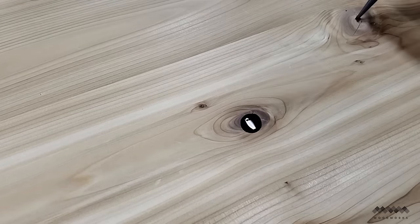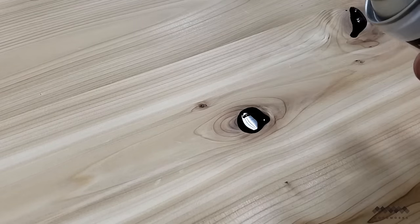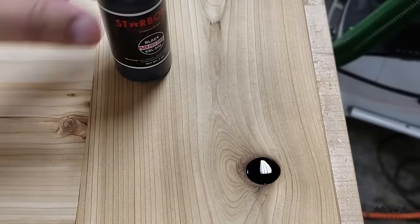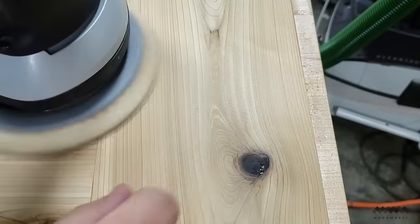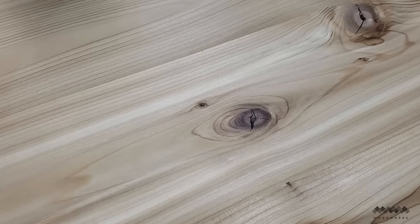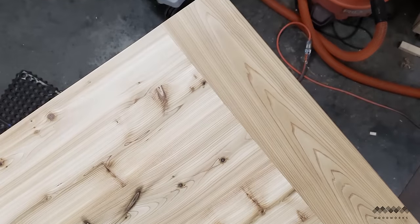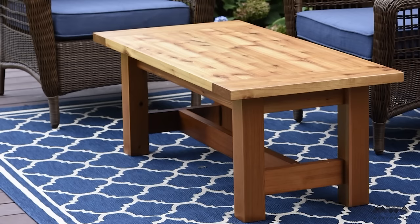I just apply the glue to the voids and let it sink in. This is a medium thick CA glue so it does a good job of filling smaller voids. A couple shots with an activator spray will speed up the hardening time — it doesn't take much to fill these small defects. Once the glue is fully hardened, I hit it with my sander and remove the excess back down to bare wood. All the little cracks and voids are nicely filled in. All that was left to do was screw the top to the base using the cleats, and I finished the piece with a clear epoxy sealer topped off with spar varnish to really bring out the color of the cedar.